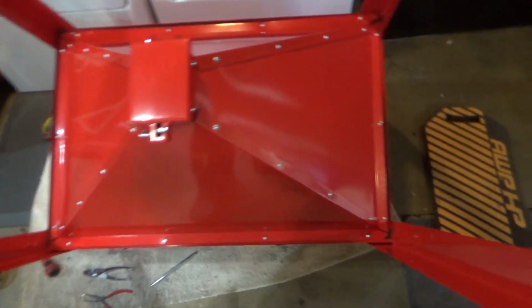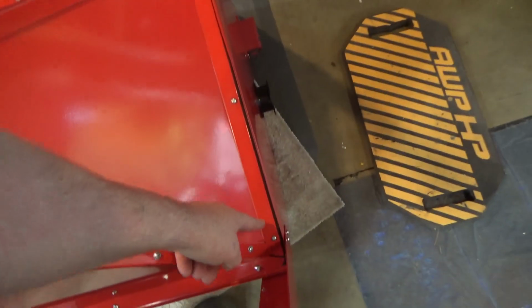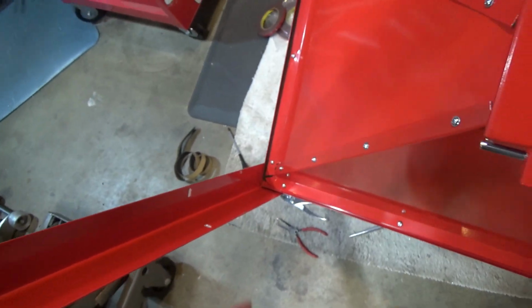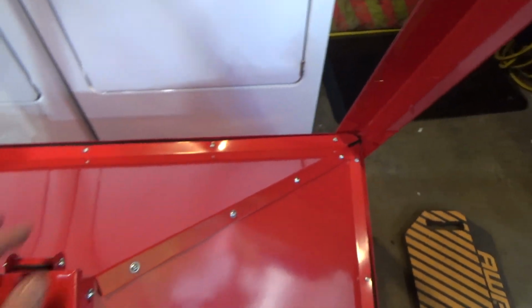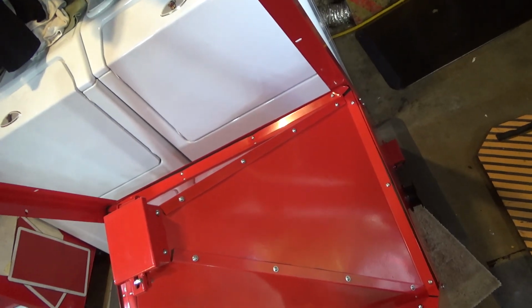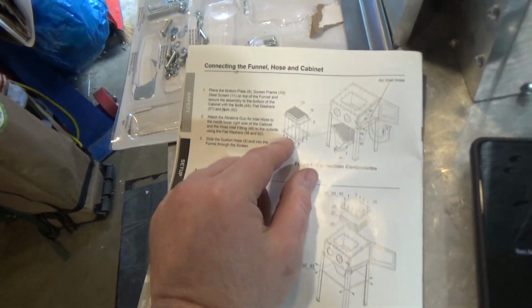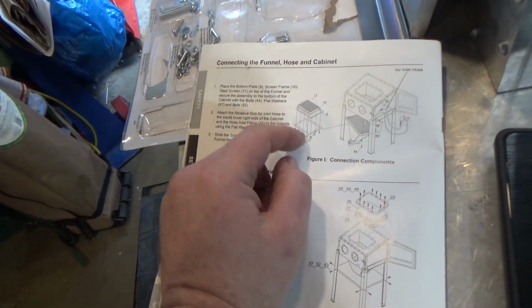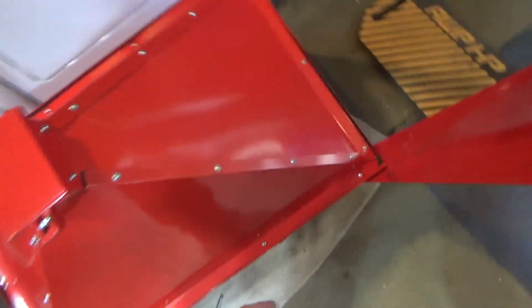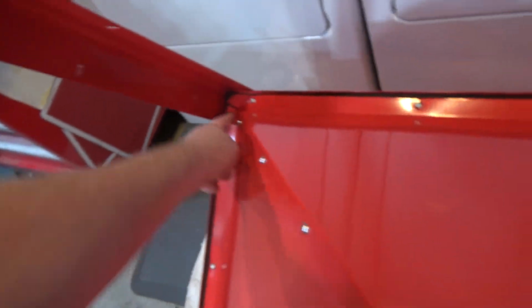And you know, maybe that flange was supposed to go on the outside of this instead, so that it would seal up those gaps. I don't know, maybe that's the case. I'm going to use foam tape. I might have gotten the order reversed. You can't really tell from the drawing, unfortunately. It looks like on the drawing, actually, that the little separate piece is in between, like I put it. But it seems like it might make more sense to put it on the bottom here, so you could seal up these gaps here that media can come out of.